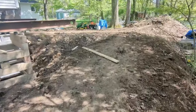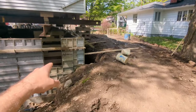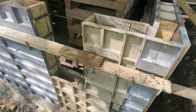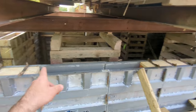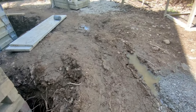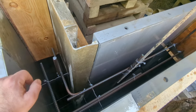Looking at the top of the wall — the rough opening for our egress window is three-sided pressure-treated lumber, but the forms stop at their standard four-foot length and the threshold is down in there. A little concrete tipped in, he dippered it out with the trowel — it's just a rough opening so no big deal. The rest of the windows are all exactly the same size box and same size glass block unit, other than the extra-deep one at the back for the major lifting beam. The foreman noted the long rebar is to ground our electrical if they'll allow it instead of pushing ground rods.